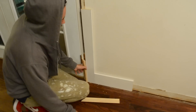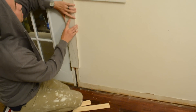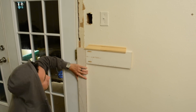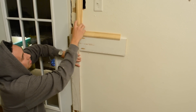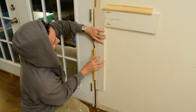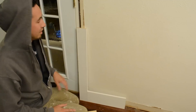In that case, what I'm going to do is use that same wrap technique. If you can imagine this as the wainscoting and the casing comes down, it's the same thing — the molding would still wrap around it the same way, just ending right here, and the other piece would continue down the length of the wall. The options are really limited only to your imagination. I hope you enjoyed this video — three awesome ways to update and make your baseboard-to-casing transitions really pop. I'll see you guys next time.